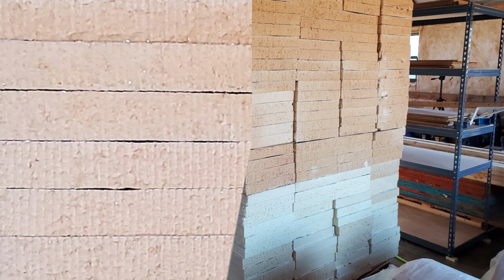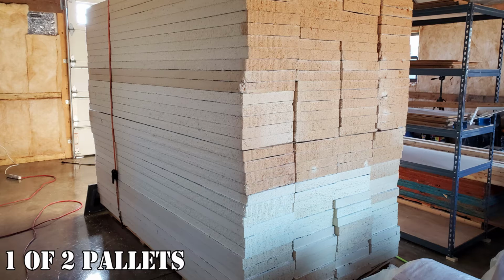And once the plastic was in place, we moved on to that mountain of 2-inch foam that you've probably seen lurking in the background of the other shots. We bought this, again, another Facebook Marketplace score. We bought it from a guy selling this foam board as manufacturing offcuts. In addition to getting a great deal, we paid $350 for what ended up being approximately 1,600 square feet of R13 claimed Thermex something or other foam board.